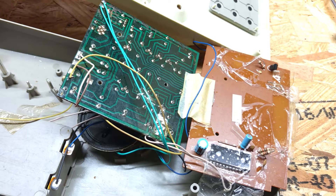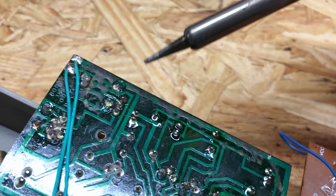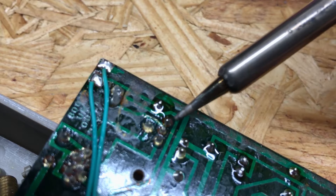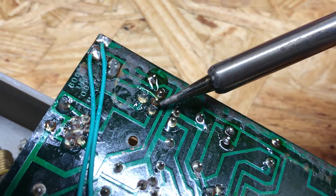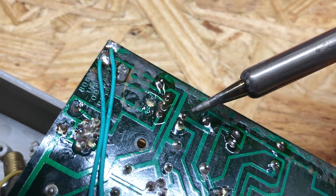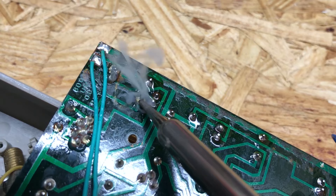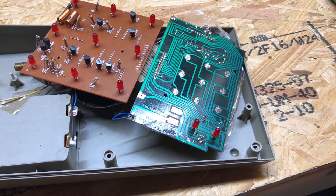I'm going to try to capture doing one of these — it's really difficult because I'm holding this with one hand. So you can see how this particular soldering iron works especially with the flux and how I reflow this solder: just touch it on there, see that, just cleans it right up. This one here I think I already did. Then we go to this one here — see that? You can just tell it gets a really nice shiny look to it. That's kind of your indicator that it's been reflowed — otherwise it has a tarnished yellowish look. Then nice and shiny.